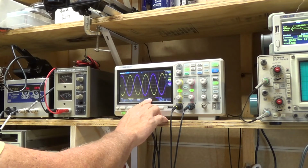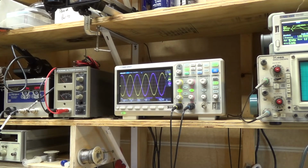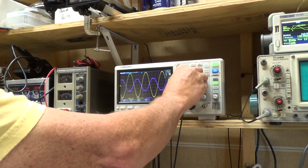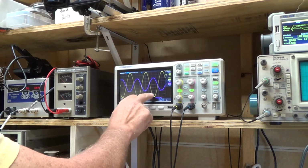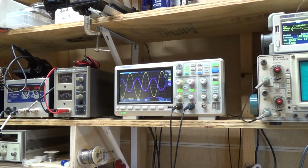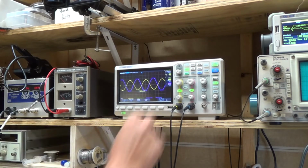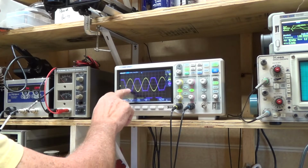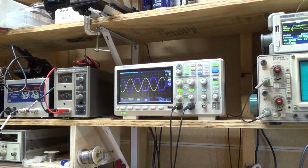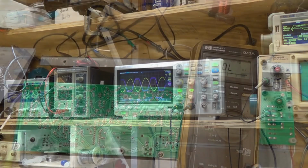And then look at our output. It's cranked almost all the way, and if I turn the volume knob past 2, we're starting to clip already. The blue line is our output. This is off our third op amp, and we're starting to clip already. So I'm going to try to figure out why that particular op amp is amplifying so much, and it's right after the tone section.